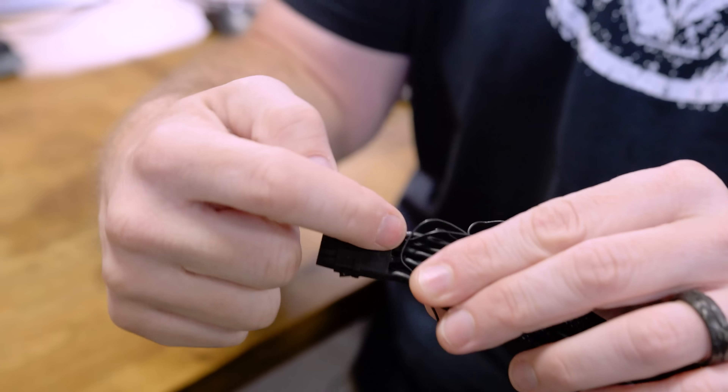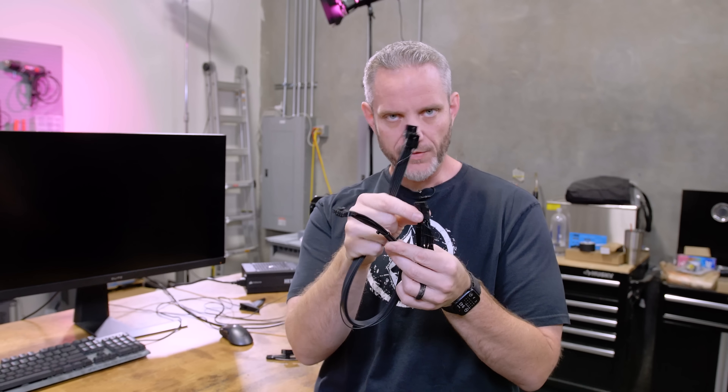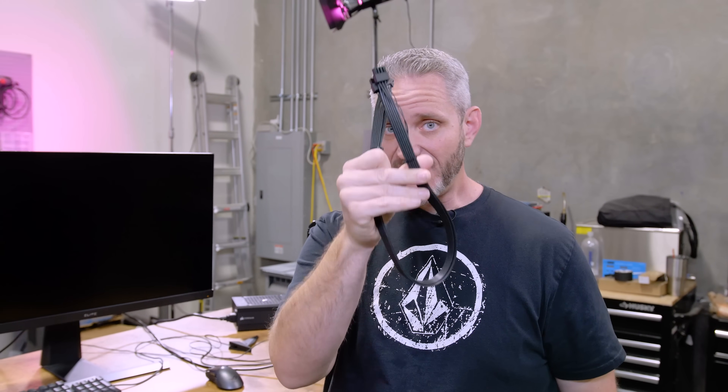So here's what I'm going to do today — Paul's Hardware also reached out because he's going to try and recreate this himself. Now that I've sacrificed this cable I'm not going to use, I want to cut it open and see for myself what it looks like in there. I still stand by what I said in my previous video about being pretty safe as long as you're using something like this Corsair replacement cable for the 4090 adapter — the 12-volt high power. What they're doing here is they have one wire per pin, a dedicated ground wire for every pin on the 12-pin side of the 16-pin plug: six dedicated grounds, six dedicated 12 volts, and these are a heavier gauge stranded cable. That's why this is a safe solution.